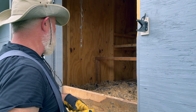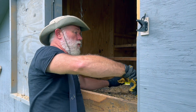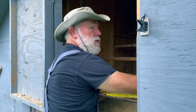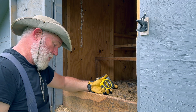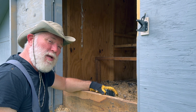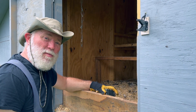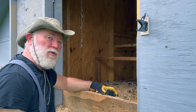I'm going to take some measurements. I'm going to be building a box that will fit inside of this door, going from wall to wall, so I'm measuring from stud to stud — looking at 67 and a half inches. The boxes should be about 13 inches by 13 inches — a nice square box. Chickens like a nice tight space. I'm not going to put a roof on them, just dividing walls in between, and those dividing walls will have a 45-degree angle on them. That should keep chickens from wanting to roost on the box, so they'll use the boxes just for laying.